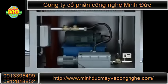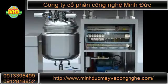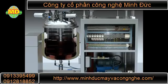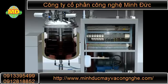2. Vacuum system. It is made up of vacuum pump, vacuum buffer tank, check valve, vacuum meter, water pressure relay, vacuum pneumatic valve, water electromagnetic valve. At the beginning of the process, the pressure at the water inlet and air inlet is around 1 atm. When the vacuum pump starts, it will draw the air in the tank through a pneumatic valve, check valve, and vacuum buffer tank. The emulsifier will not cause any foam under vacuum state.